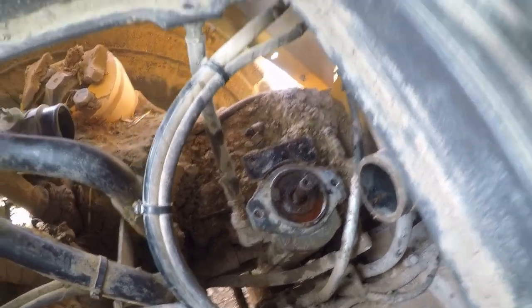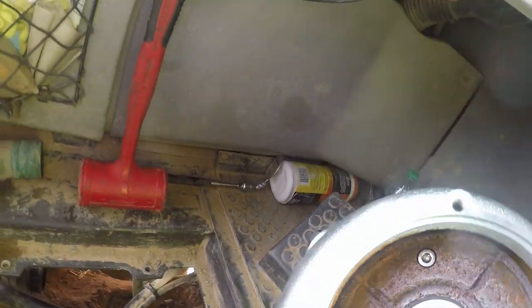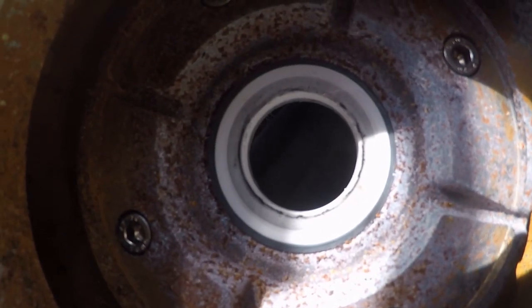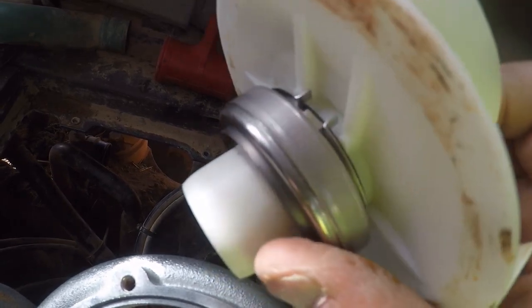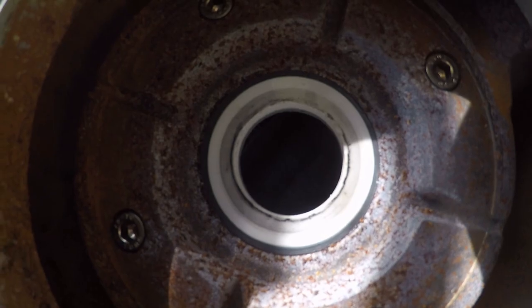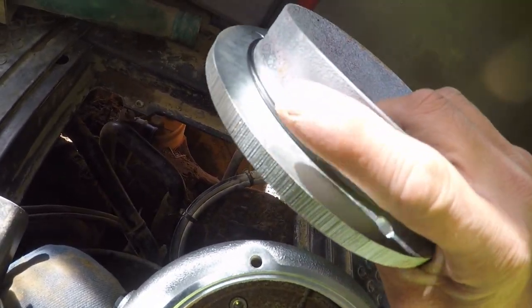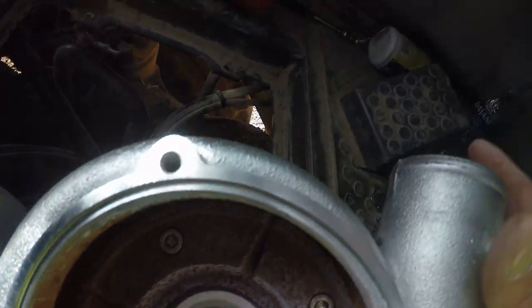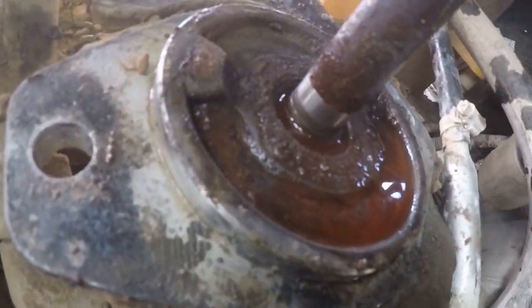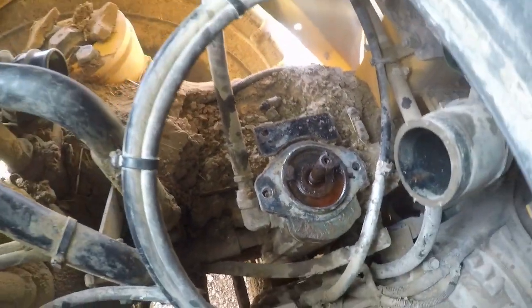We got that water pump off. Let me talk you through it real quick. They've got an O-ring right in there between this plastic and the casing, and that O-ring is also on the inside here — that's what's going to keep it sealed on the impeller itself. It's almost like a bearing but it's spring-loaded, so having this bolted down keeps pressure on that plastic, which keeps pressure on the O-ring. Here's the top half — it's got an O-ring right there. So we're going to go back together with this one. We'll mount this part first, then slide the impeller on, because the front part was tight — I had to pry it off the shaft. You can see the clean spot where it's been riding, and you've got all that grime to plow through as you come apart.